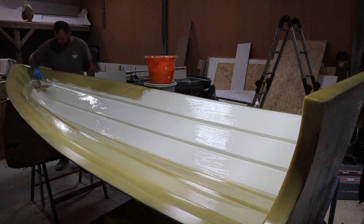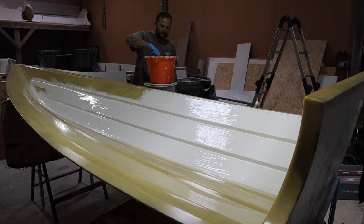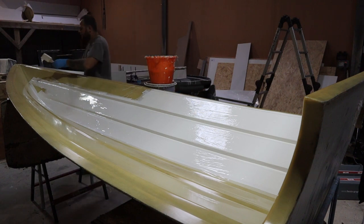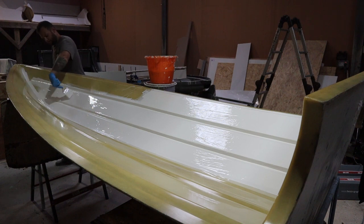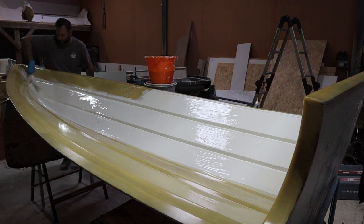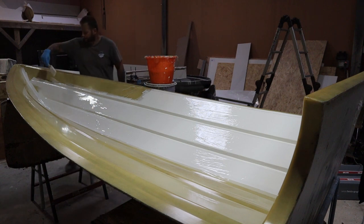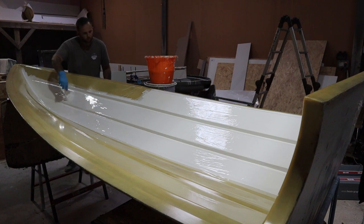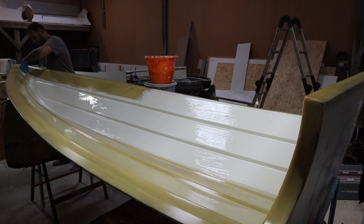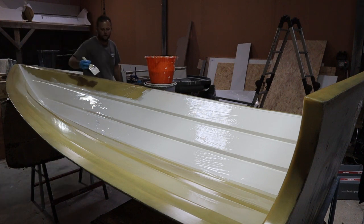And then once you've got those two in, these cheap brushes just throw away, but they drop hairs. We'll get the mat sorted out for the first layer. So, same as anything, we start with an isophthalic layer on this, which is resistant to water, resistant to fire, and a lot of other things. Oh, bugs love this as well.